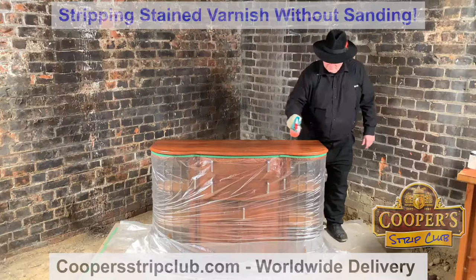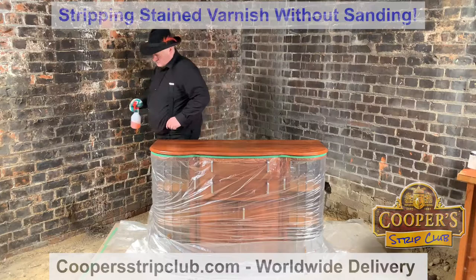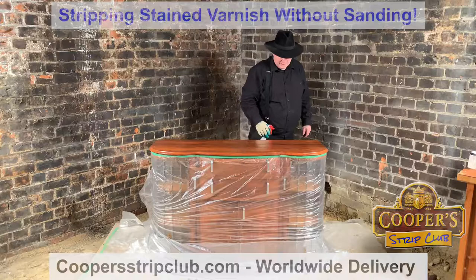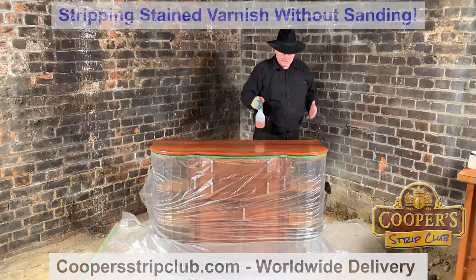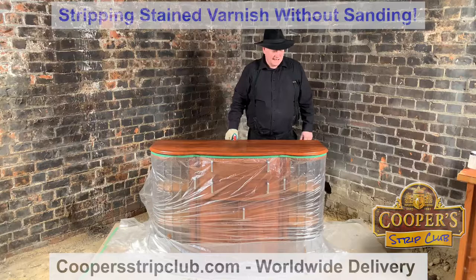That's deep in the grain and this is how you can get into these areas really easily. Always note that I'm moving my hand, sweeping it — it's not so important for a top but for the sides it will definitely be important. The grain's coming up really, really beautiful. Being a thin stripper and not acidic or alkaline, it's going to absorb into the wood causing no damage to the timber — so there's going to be no furring or anything like that.